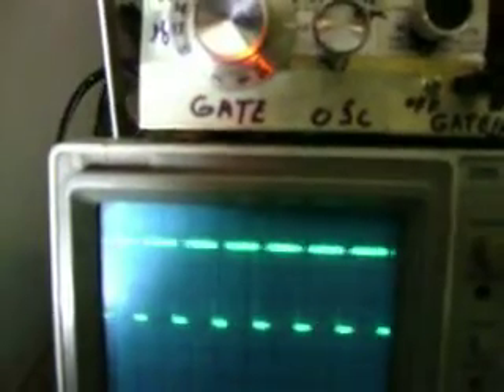Right now I've just got the main oscillator going. As you can see we've got a nice square wave. This one here is the coarse range, which basically adjusts the frequency range of the main oscillator. Here's your fine adjustment and you can see the difference it has. This thing's also got a mark-space control. When you adjust the frequency you see it starts to go away from a square wave. You use mark-space to adjust and get a nice square wave again.